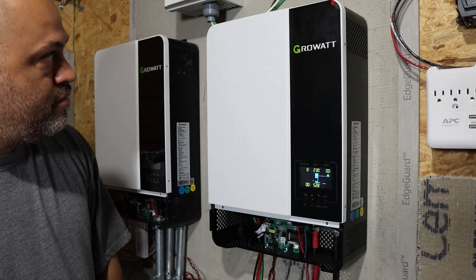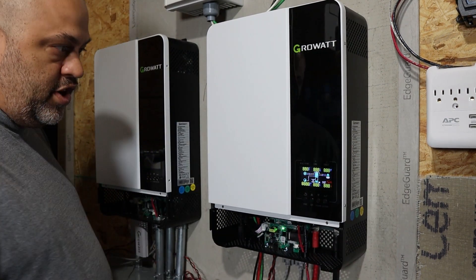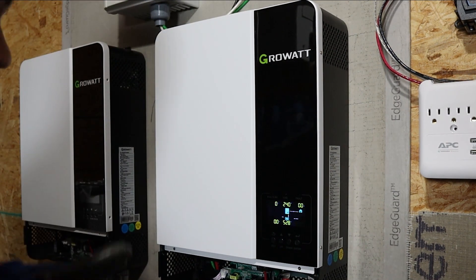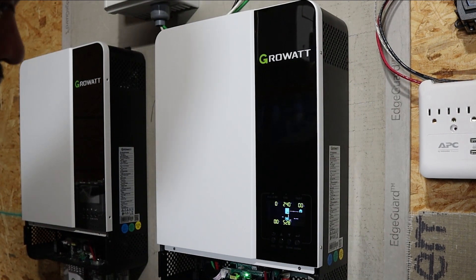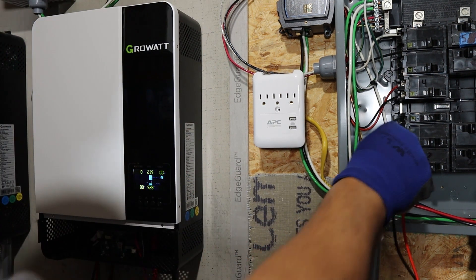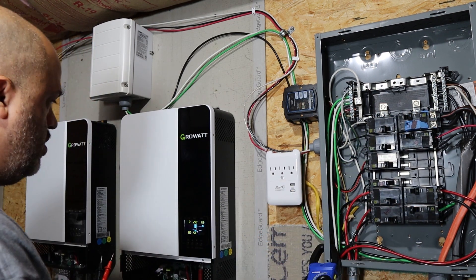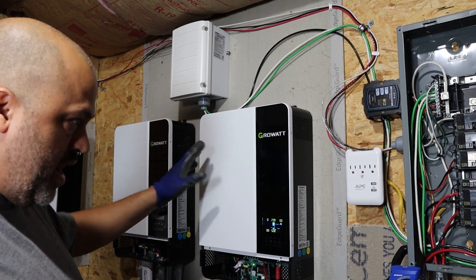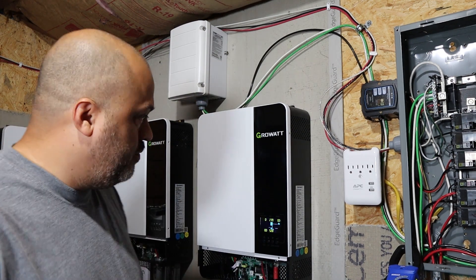The inverter is making a buzzing sound. Let's get it completely set up — put it on 240V 60Hz, set it up in parallel, then worry about any noise afterward. It's outputting voltage but making a slight beeping sound. I'm going to check the voltage on the panel — 240 volts. I turned the auto transformer on, made sure all other breakers are off, and turned number one on. I'm about to check all the wiring because it looks exactly the same as before.